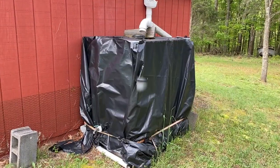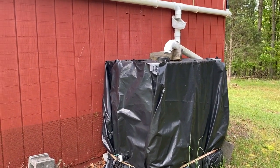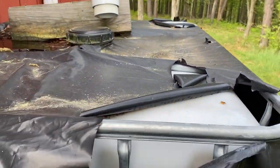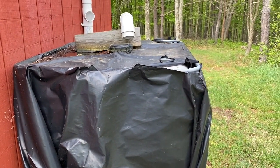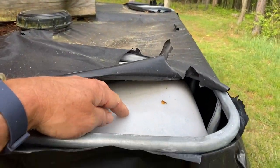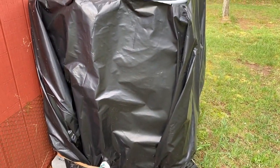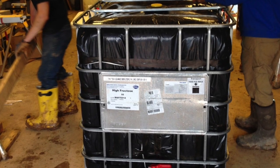Let me show you one other option. Here we have wrapped an IBC tote in plastic — we did it kind of the easy way. We had the plastic, it didn't cost us anything, and we just wrapped the outside cage and all. It doesn't look the prettiest, but it's worked for actually four years. You can see it is starting to fray and the plastic is just starting to tear up on us. A better way to do this, which will have it last longer, is to remove the bladder of the IBC tote — the plastic part from the frame. Once it's removed, go ahead and wrap just the bladder itself in black plastic or whatever color you have. Then duct tape it down near the bottom, put it back into the cage, and it lasts much longer that way.